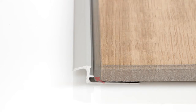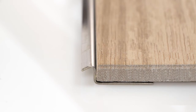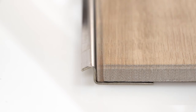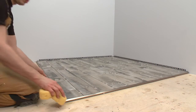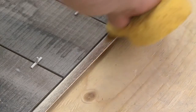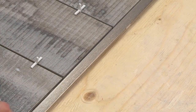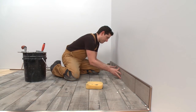Set the tile up to the integrated joint spacer — this will provide a uniform grout joint. If you are using the Reno TK in stainless steel or brass, there is no integrated joint spacer, so you will need to leave a space of approximately one-sixteenth to one-eighth inch. Don't forget to clean any excess setting material immediately from the profile to avoid any damage to the finish. We complete the installation by setting the remaining tiles.